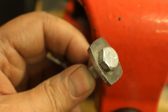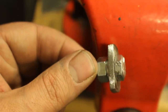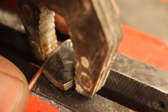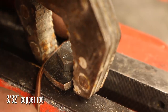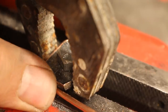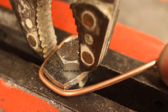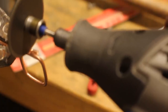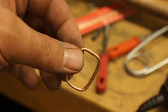This little thing I've made is a piece of 1/8 inch steel — it's a little form with a bolt going through it, kind of bolted together. I made this so that I could use some copper rod and bend it perfectly and evenly five times. This worked out pretty well — this is for the little surrounds that go around the stones. Cut this off and there you go — perfect.